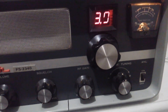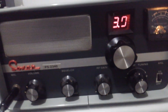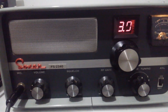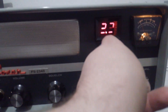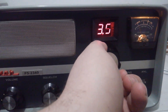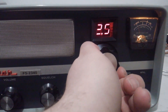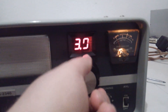Obviously we'll show you here. We've got key down but we've got no modulation, no power output. Could be a tube, could be something else. We're going to test all the tubes in it. We've got our display here and you can see it's got that little red dot on it — that is a common problem in the Sonar 2340s. We're going to replace this display because it's also got some segments that are out, some that are trying to go out, some looking pretty weak, and some all the way out.